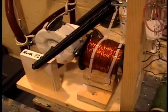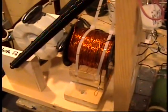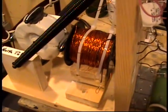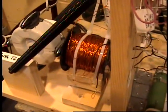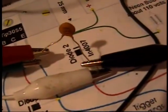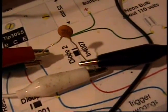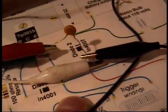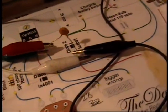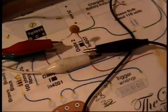As you saw in that animation, when any electricity goes through a wire it creates a magnetic field, and when the current stops flowing the magnetic field collapses. We're going to measure that magnetic field collapse. Moving to the back of the machine, I have connected up a tiny capacitor — this is a 104Z, a 0.1 microfarad capacitor. It's just enough to slow down the high peaks I'm going to get from flyback so I can measure the voltage.